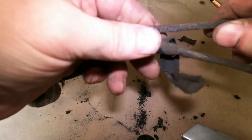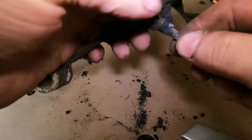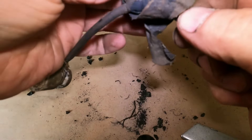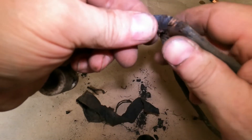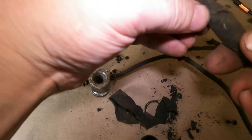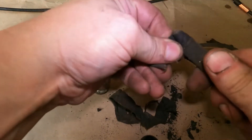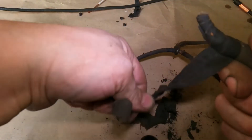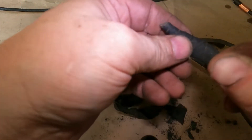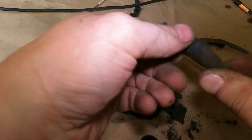Now I don't think this was a part of that piece that I saved. This is another wire. I don't know what's going on here. Again, this is why we have so many problems with knob-and-tube wire — inappropriate connections. There's not enough wraps, there's no solder, there's no mechanical connection to reduce the resistance.